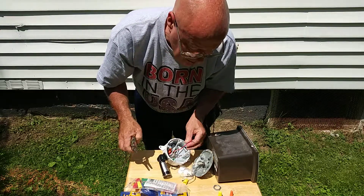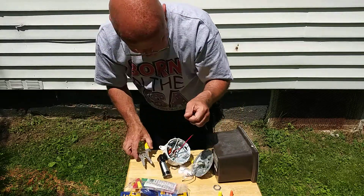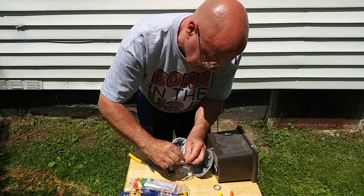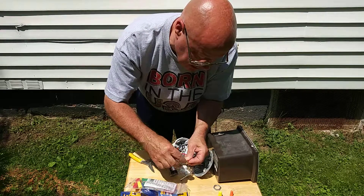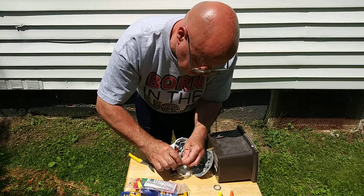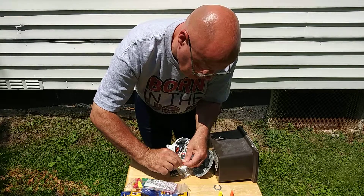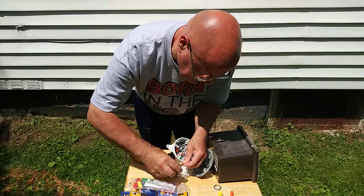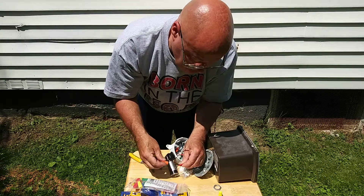We'll take our red wire — it goes to the black wire on the light. I'll clip the black one back a little bit. So the red from the eye goes to the black from the light, which goes to the red that goes to the eye. We'll take our strands and cross them, then twist them together, getting them even, and put an orange wire nut on them.